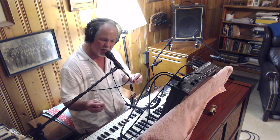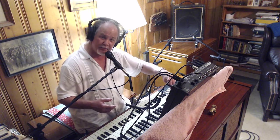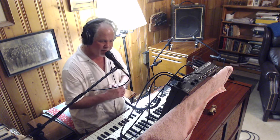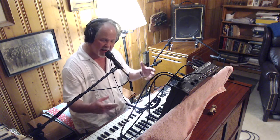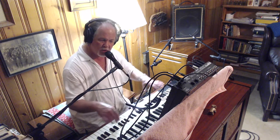It can take it right off of the tone preamp, or it can take it off of the internal amp, which is the speakers, and so that's what it was meant to do, so that you can harvest the reverb. So I tried taking it off of the preamp, and it sounded okay, but it didn't sound peachy to me. So I said, okay, let me go ahead and spend some time. And I hooked it up to the speaker level signal, and of course, that amp that Marcus rebuilt has a bass boost on it, so that the internal speakers have a little more bottom end for your pedals.